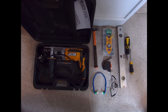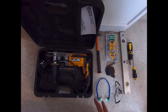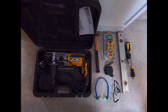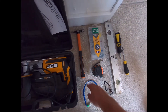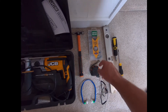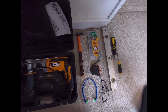Okay, so kit and equipment you're going to need. You're going to need a hammer drill or a hand drill depending on what material you're drilling into. If you're going into masonry then you'll probably want a hammer drill. If you're going into plasterboard or wood then just a normal hand drill will do. The appropriate drill bit depending on what material you're going into. A little pin hammer to tap wall plugs in if you end up using them. Some hearing protection and eye protection, tape measure, your wall plugs and screws — have an assortment so you can get the best fit — and then a spirit level and a couple of screwdrivers as well.